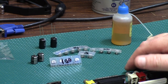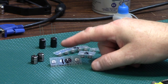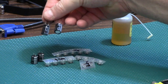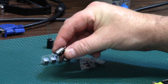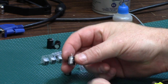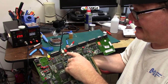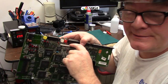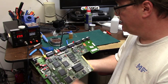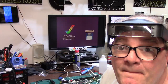Just like that, all the caps are off. The cap kit from amigastore.eu comes with all the caps for a 1200 — reference 1399 according to them. Values are 100, 47, 22, 10, and you get the two 1000s right here. They're Nichicons but these are NHG with pre-formed legs. Keep an eye on your negative bar to know which way you're going. 18 new caps installed. I had a bit of trouble with one in the back — got a small scuff mark — but even with a fine tip only stabbed myself once. Everything came out very clean.